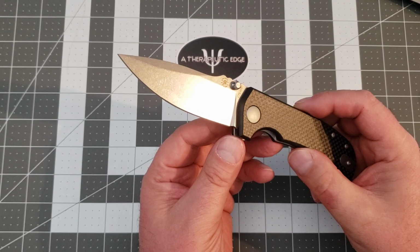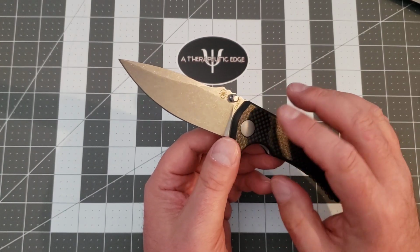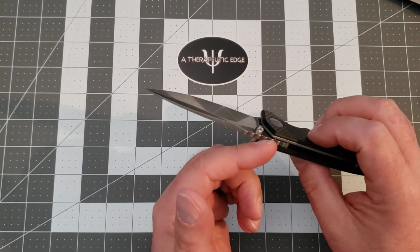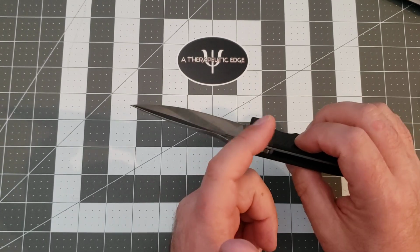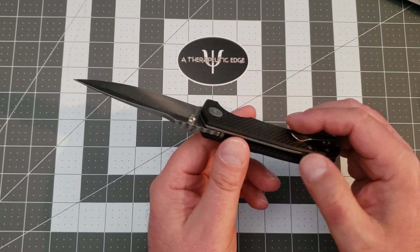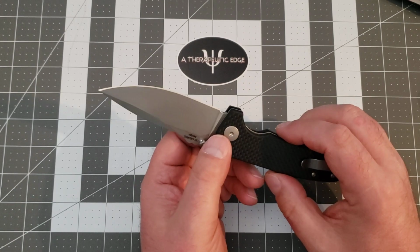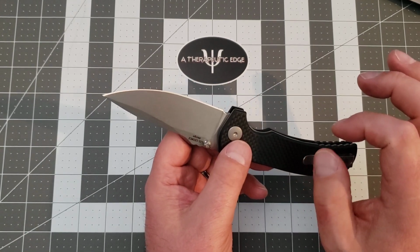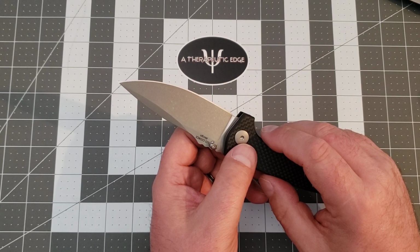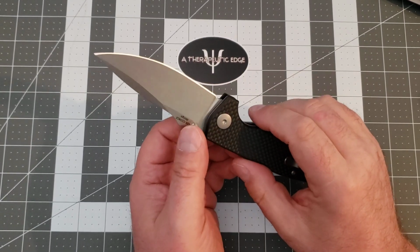It has, well, let's see. It's got phosphor bronze washers on top of basically plastic washers, nylon washers, or the other way around. I think it was nylon and then, anyway, there's 4 washers in this thing, 2 nylon, 2 phosphor bronze, and then in the pivot itself is a copper or brass fitting that they call their oil-infused bushing of some sort.